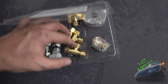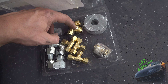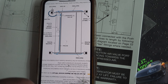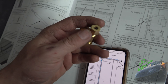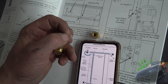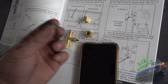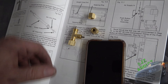This is our hydraulic pressure hose and we've got all our fittings. Three fittings are for the airline — they engage and disengage the locks — and two are for the return line we're making. We've got one, two, three T-fittings to position and rough in the tubing. Personally I'm not a huge fan of these compression fittings with the built-in plastic ferrule because it's easy to over-torque and strip the threads, and if you don't do it tight enough they leak too.